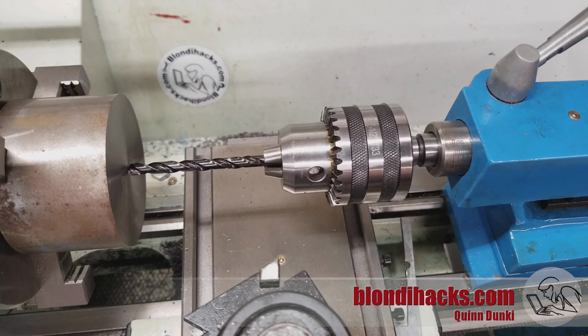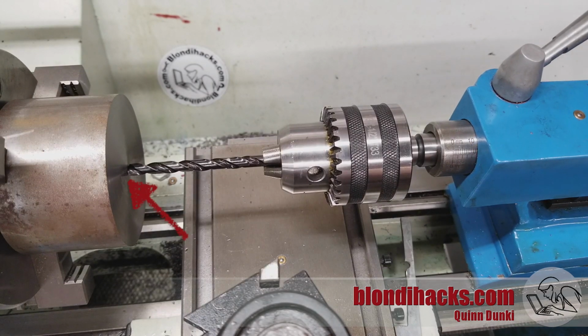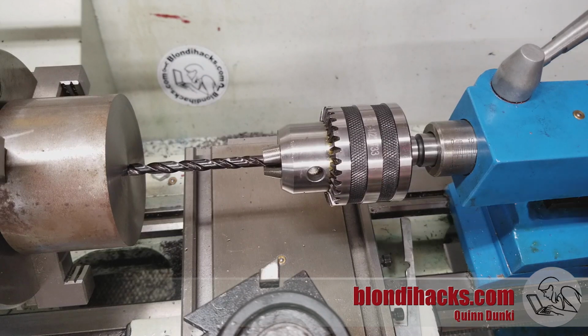And so now you've got the front of the drill flush with the work, and then you've got a 0 on your hand wheel and a nice whole number on your quill markings. So now it's easy to count a precise depth. Now this isn't going to be perfect because the end of the drill is going to be seated into your center mark a little bit. So it might be off by 5 or 10 thou because of that. But generally speaking, this is an easy way to get a depth accurate with drills to within a few thousandths.